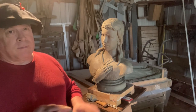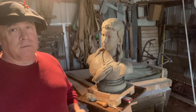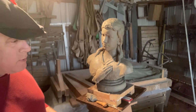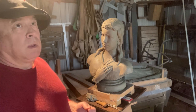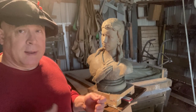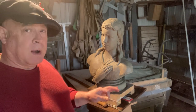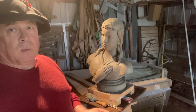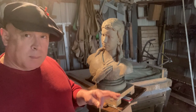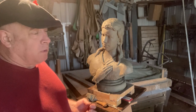These straps are supposed to be rated for a lot more weight, and nothing's supposed to go wrong — but if you're underneath something that weighs a few tons and anything goes wrong, you lose. I've been trying to figure this out because my 3-ton hoist is rated at 3 tons and it's a safety hoist. It's clutched at 3 tons — it'll go to 3 tons and then it'll slip. It won't pick up any more. So I don't know if I pick this 4-ton stone up and try to manipulate it with my 3-ton hoist if it will actually handle the weight — and so I can't risk it.